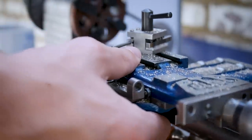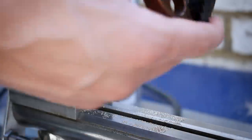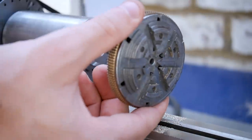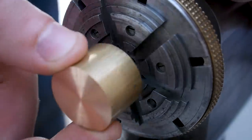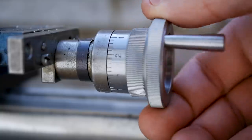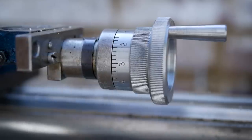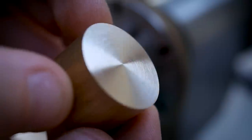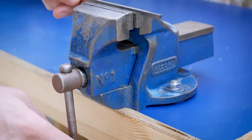Regular viewers of our channel will be familiar with this little watchmaker's lathe. The machine is a custom build, but this project can be done on more or less any lathe. Regardless of the price or quality, every machine has its quirks that we must work around. In my case, my four-jaw chuck is not perfectly axial, so I swap for the more accurate six-jaw to face off the opposite side of the workpiece.